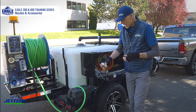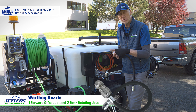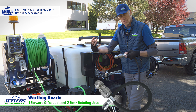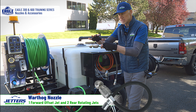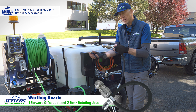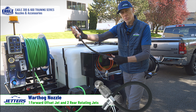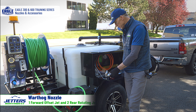The Warthog is fantastic for catching things the Reaper misses. It has a forward coring jet that moves much slower — relying on controlled rotation — but the two rear jets are the stars of the show. Those thick, rotating jets scour hard and tear out anything the Reaper missed, such as heavy grease at the top of the pipe or root intrusions. It's also wonderful for storm lines with a lot of silt at the bottom, as the slow-rotating jet dredges up that silt. When you jet upstream and pull material back — manhole to manhole or from an interceptor — the Warthog gives a great scour and pulls material back toward you very well.